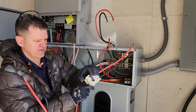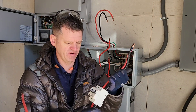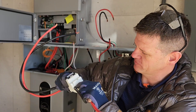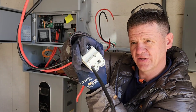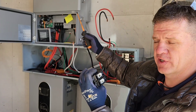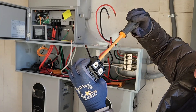This was a disconnect for my grid so I could work on the system without having live power, but I really have not liked this little disconnect switch — I haven't trusted these connections. If I had a lot of current going through them, I don't know if I'd trust them because it's just two metal plates that tighten next to each other. See how loose that is? I tried tightening these down but they just kept loosening. The Grid Boss comes with an actual breaker, and if we want to turn off power to my inverter to work on it, I'll just flip this breaker. Look at this lug — this is a lot, lot better.